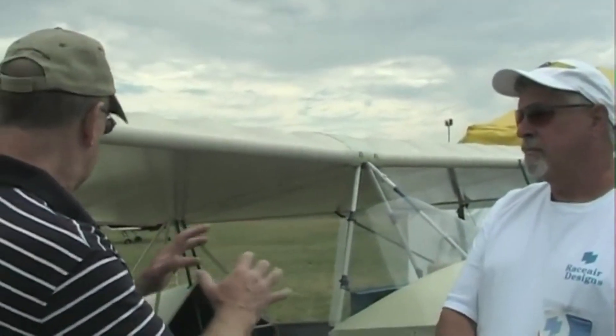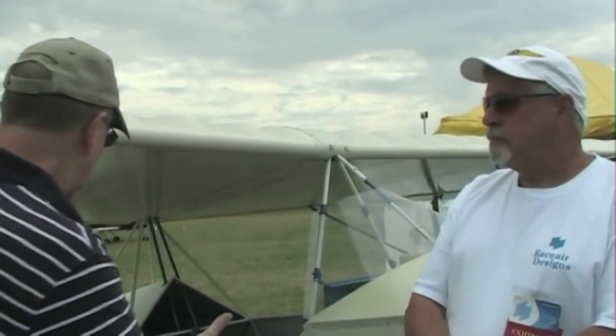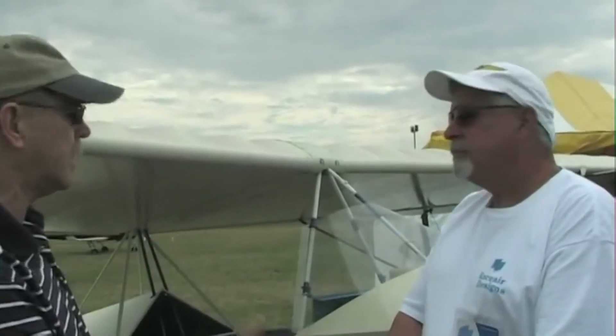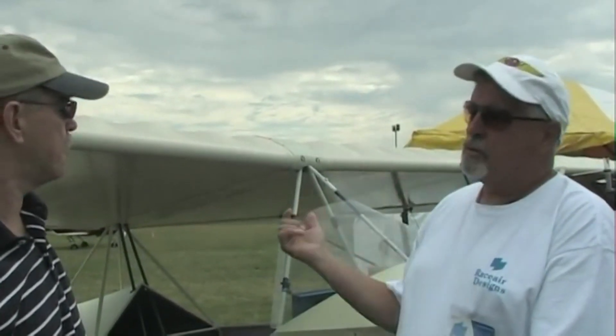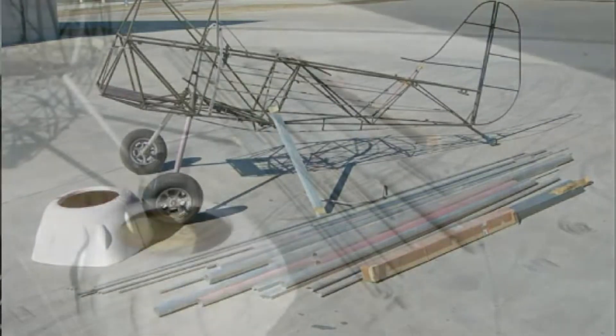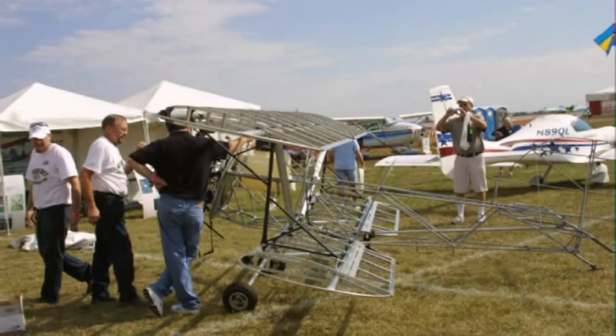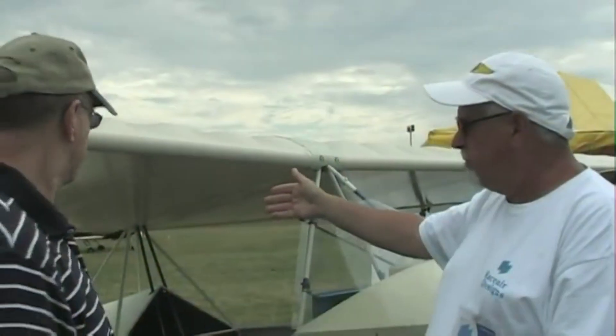So that leads right to the next question about what's it all made of? What are the component parts? I see some aluminum, I see some welded steel. Give me the general review of what it's made of. The basic steel tube fuselage, 4130, welded, gas or TIG. The lift struts are aluminum. The landing gear legs are aluminum, tube within a tube. The wings are the typical ladder construction of the early ultralight days. It's a rigid tubular drag and anti-drag bracing, fabric covered with nose ribs. Tail is aluminum.